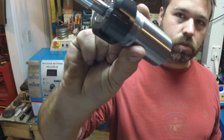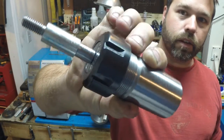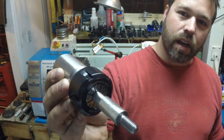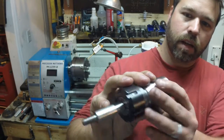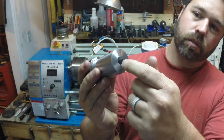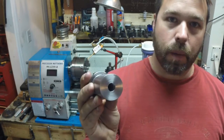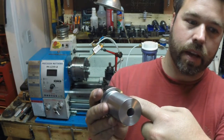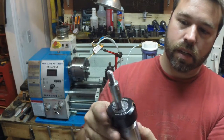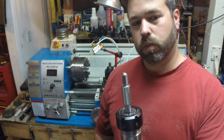This is the M40 by 1.5 millimeter thread here on the end. I have a part tightened up in there that I was using just to check it. I drilled it all the way through, and if it works like I think it will, I plan to drill and thread it to 3/4-10 and then make a work stop that'll screw in from the back side — so when working on short pieces I can set things at a consistent length. Just something I'm playing around with.